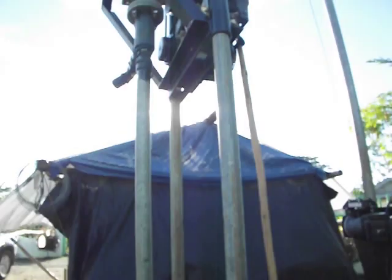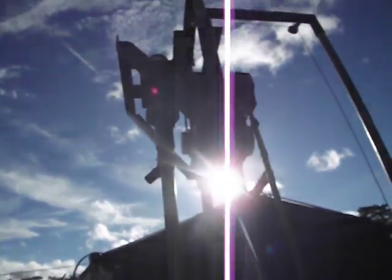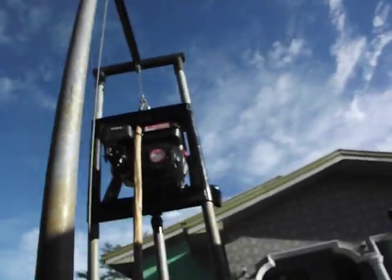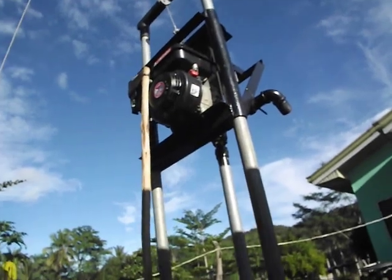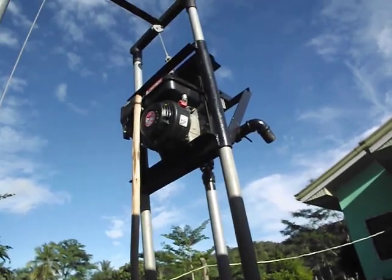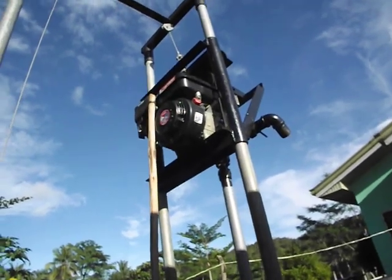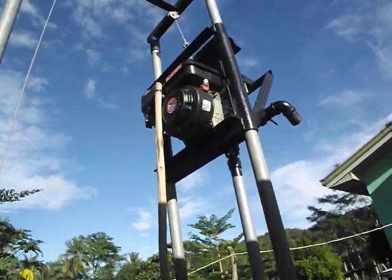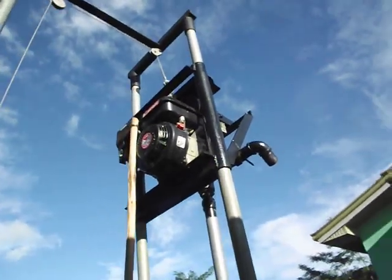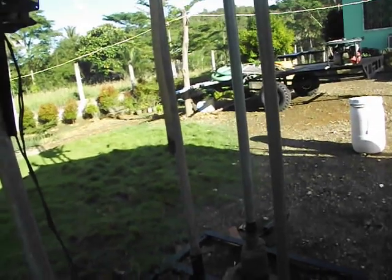So that's a demonstration of it running. I didn't like to go any faster, but you could actually go quite quick if you knew it was like sandy ground or something. If you're going on really sandy ground where you're worried about it caving in behind you, there is an additive that you can get — it's a bit like plaster. You put it in with the water and it actually lines the side of the hole as you're drilling down to stop it from collapsing. You could use something like skim coat — mix that in with the water and as you're drilling it clings to the side of the hole and seals the sand so it doesn't fall in.